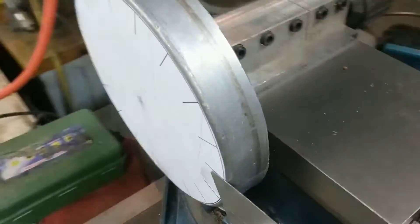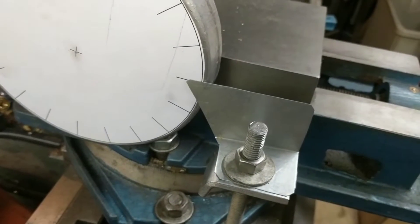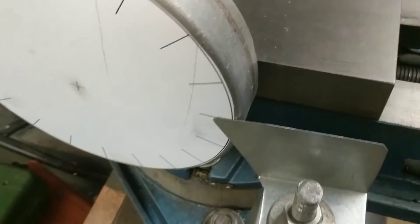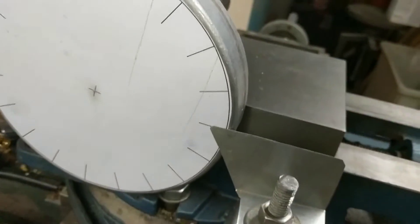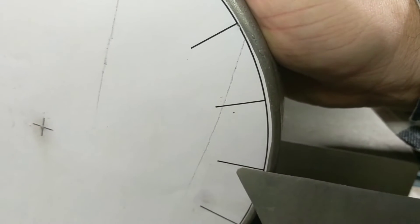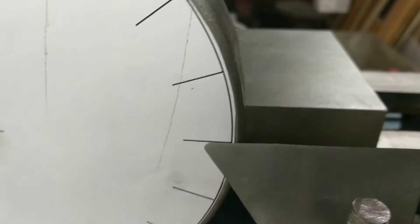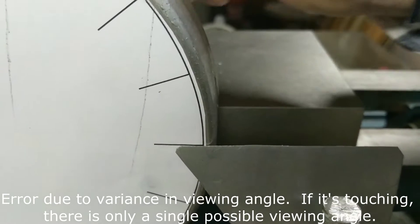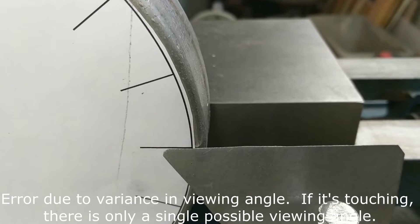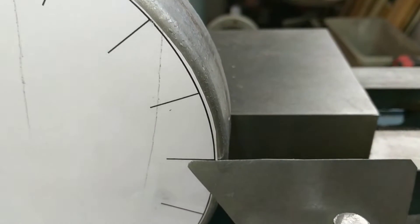The other critical thing is that this pointer needs to be very solid. I have mine bolted straight into one of the clamping slots. It needs to be very close — I actually have it touching the surface. By having the pointer very close to the line, it greatly limits the likelihood of having an error in where the line is indicated. I stop the instant the white disappears at the very outer track — that's what I consider a point.